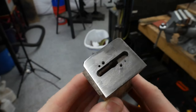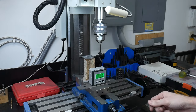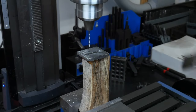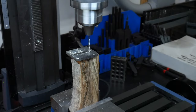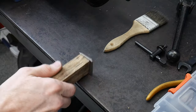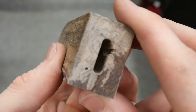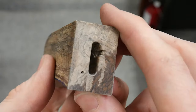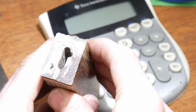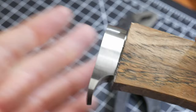These lineup pins are around one-sixteenth of an inch in diameter and about one inch long. The digital angle finder does a very good job at verifying that the block's face is parallel with the top of my vise. For this knife I'm drilling these sixteenth-inch holes around 800 thousandths of an inch into the block. I did get one lineup pin a little too close to my slot and some material broke away, but I still had about a third of the pin hole left and I'll be filling this void with epoxy. The fit with the guard was very good with no gapping between the handle and the guard.